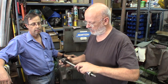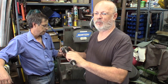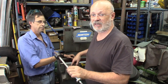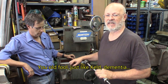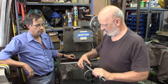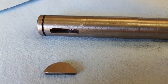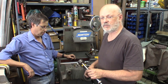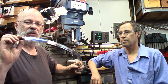We also had a little issue with the cable mechanism — the Woodruff key and the slot into the wheel weren't fitting very well, so there was backlash in there, which is not appropriate when you want to dress your wheel. This is where you lock your X and Y movement. Now this has been dressed with a nice new key made to measure, and this is going to be very sturdy and solid.